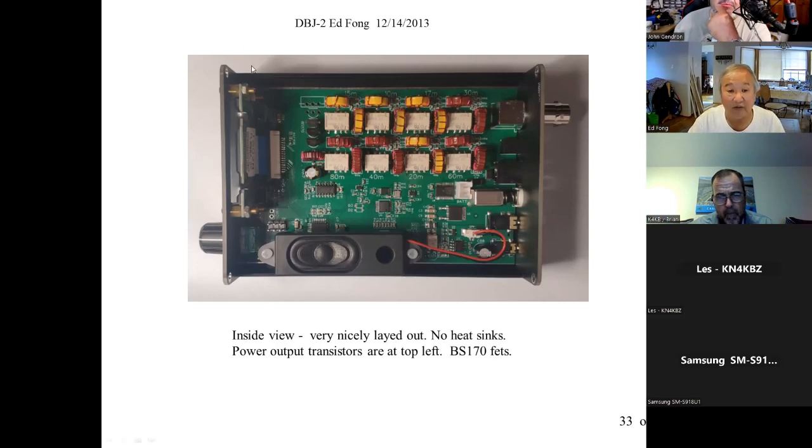It's so efficient. This puts out 5 watts, no heat sink, it's a switcher. It's about 80% efficient on the higher bands. On the lower bands, it's about 90%. At 10 meters, it's still 80% efficient. It's amazing. The guys that did this put in a lot of effort over the years. But really, Dan Tayloe and Wes Hayward. These guys are sharp guys, man. And then this Manuel guy from Germany, and then they took the RF amplifier.